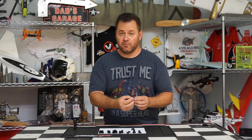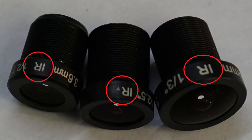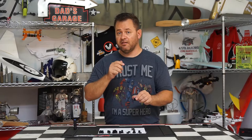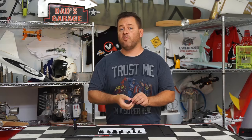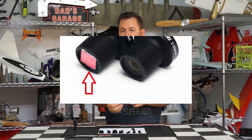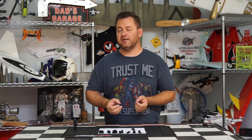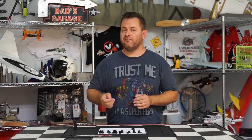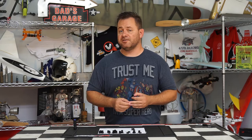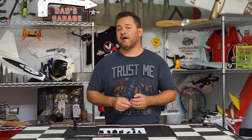If you're mainly doing racing, flying in parking garages, or flying late at night, you want an IR-passing lens. An easy way to identify this: most quality lenses will have 'IR' laser-engraved on them. That does not mean it's IR-blocked — it means it passes IR light. On the flip side, if you want IR-blocking for rich colors, look on the back of the lens for a small piece of glass glued on — that's the IR filter, which you can remove if you're careful. Also note that some sensors have an IR filter built in, so make sure your sensor is IR-sensitive if you want good night performance.